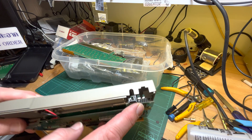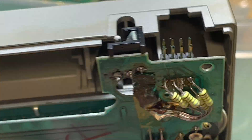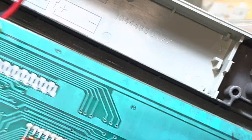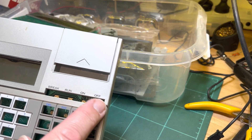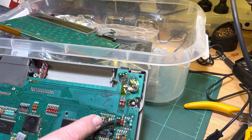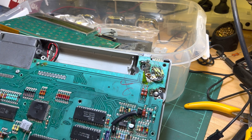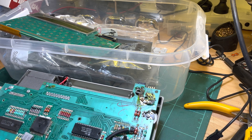You've got the hex bus there — that's the hex bus interface. And there's your cartridge port there as well, so the cartridge goes in like that. It had soft power-on but it wasn't staying on. I think the idea is that it switches a transistor so the power remains on — that's generally how soft power-on works. But it wasn't really working, so I was trying to figure that out.